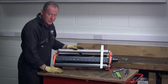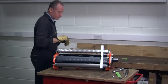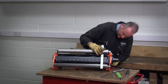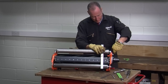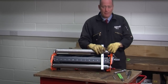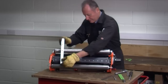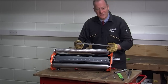If it doesn't go, I need to make an adjustment, and I do that with my half inch spanner. I release the clamping screws at the side of the cutting unit and make the required adjustment until I have the smooth sliding fit that I'm after. Then I clamp the unit and check again. Normally there will be some minor movement when you tighten up the clamping screws, and it's very important that that be checked — I'm again looking for a smooth sliding fit at either end of my cutting unit. So it's quick, it's simple, and it's easy.